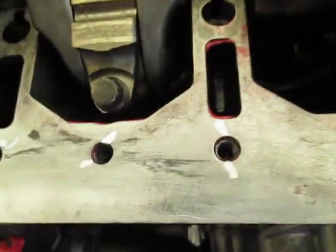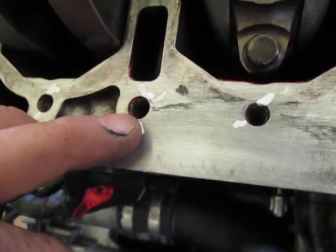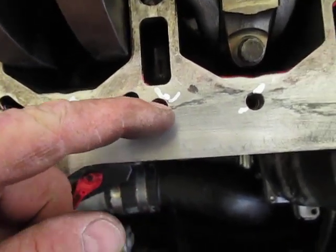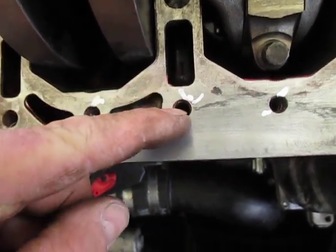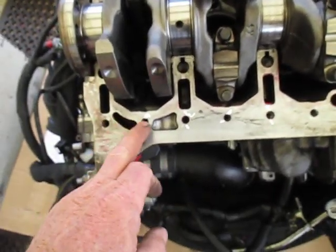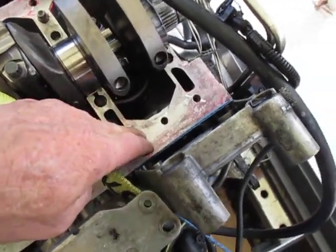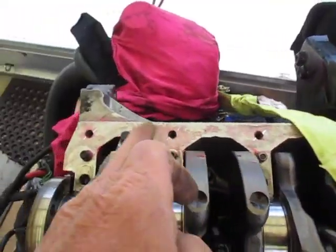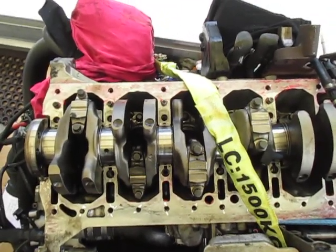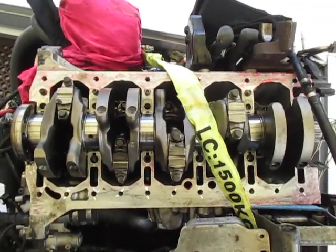We'll be drilling and tapping to about M10, depending on their special tool, providing a countersink on the head, and they'll be inserted down about one and a half D. We've got seventeen of them to do in total — five of which are M7, and the rest are all M8. We'll see you in the continuation.